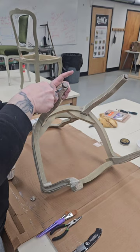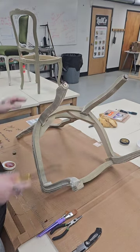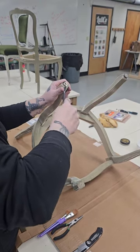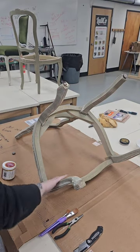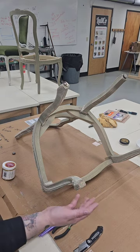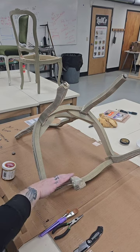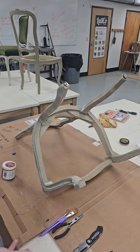So I'm doing a lot of crazy stuff to all of this. I put my paint coats on in layers of washes, in really thin coats so that they dry pretty fast. What I mean by that is I'm going to start with a base coat, and then I'm just going to build up layers of different colors of paint on top of this. Typically, I might use anywhere from 8 to 10 colors at a time. You get that really vintage French provincial look, but you can use any color you want, and so I like to use crazy colors.